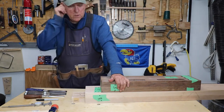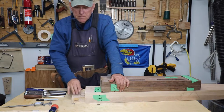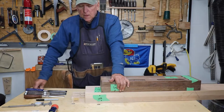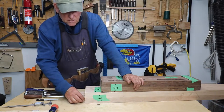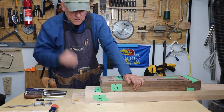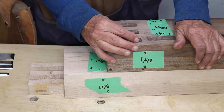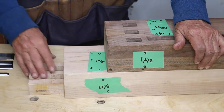I need to get those cuts made somehow. I could cut by hand, but that's a lot of work — particularly with so many of these connections. I have power tools so I want to use them. I take this to the bandsaw and push it across, making sure I stay in the waste area of my line. In other words, when I'm done cutting on the bandsaw I can still see my lines, and those lines should be the exact width that I want.